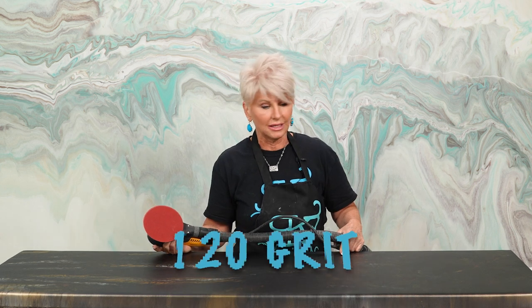One reason we really recommend applying a flood coat of clear epoxy over your color coat is for this exact reason. If you need to go and reapply your UTC, you're going to have to sand everything down. If you don't have that clear flood coat, you don't have that barrier of protection between your Ultimate Top Coat and your color coat, and if you're not really careful, you could burn down into your color coat. That's why we normally recommend that you do put a flood coat. I'm coming in here with 120 grit and I'm going to sand it very thoroughly, then follow up with 220.